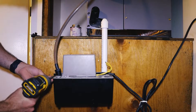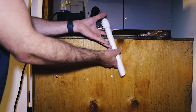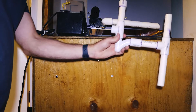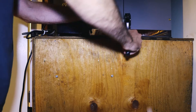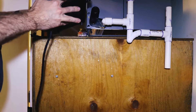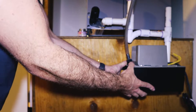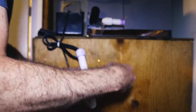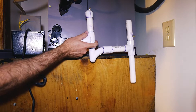There you have it. I'll start by removing this pump, move it to the side, and put my P-trap assembly over here. I need to cut this pipe off a little bit. Before I glue everything I'm just going to make sure it all still fits with the hose. Yep, that'll work right there. I'm going to put something on the floor so the primer doesn't drip. You do want to make sure that this is going a little bit downhill — you don't want it angled up.